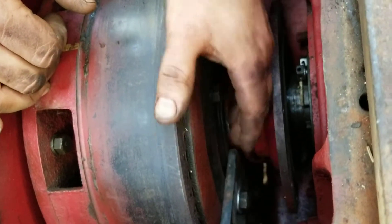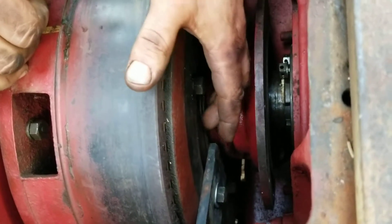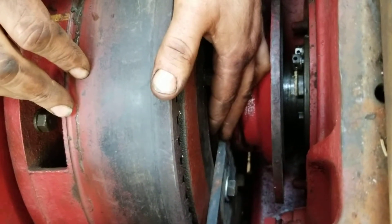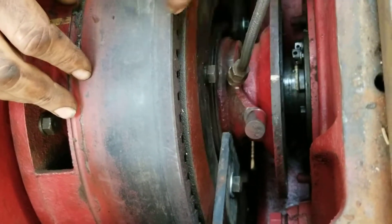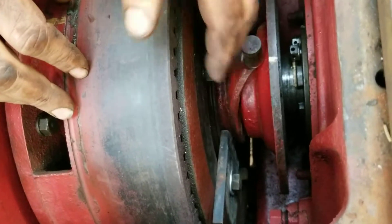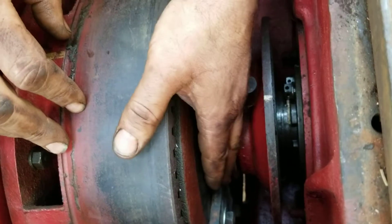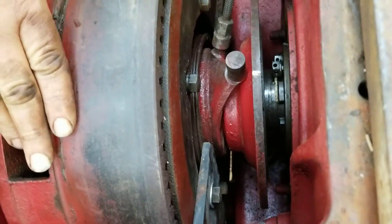This plate holds the clutch in — it's like depressing the clutch. The plates are all loose now. One thing to note is that this plate can't be any thicker than about a quarter inch, because it has to go past the casting on the bottom and also has to clear this grease fitting — and it barely clears at a quarter inch. There are pictures online of bigger ones, but I don't know how they're turning the clutch all the way around or getting past this. Don't make it any bigger, but a thinner one just bent, so I had to go with this heavy plate.